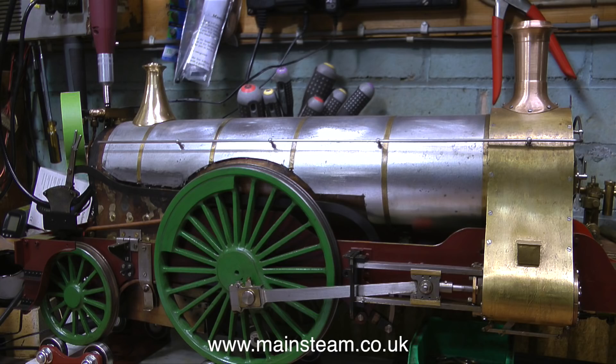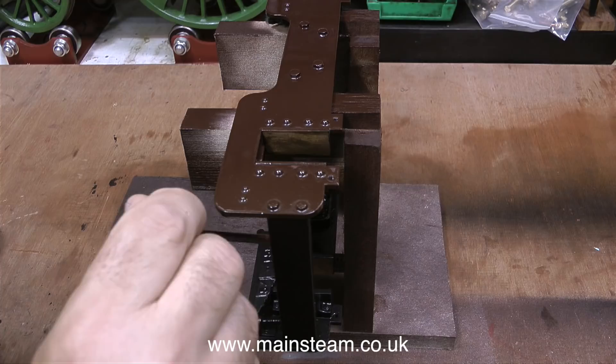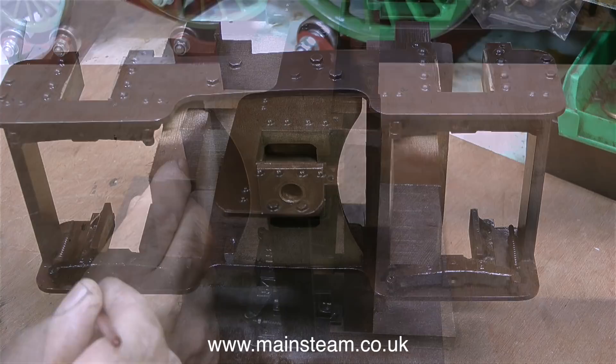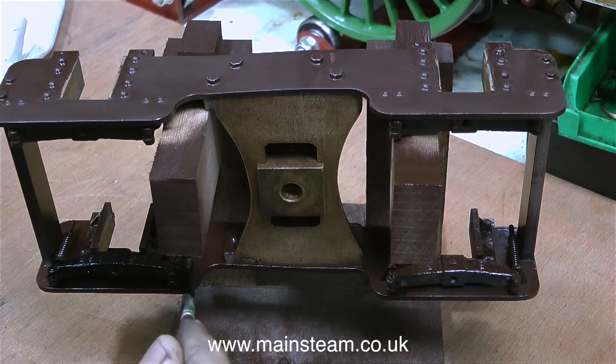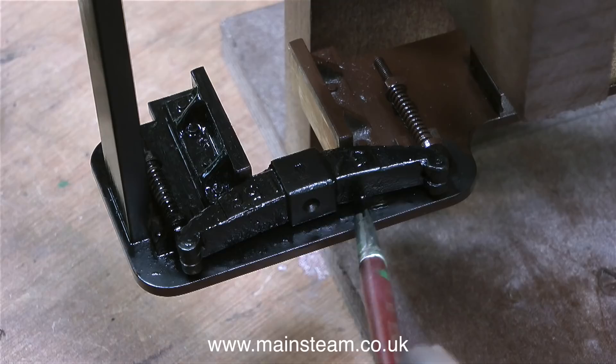So what have we here? It's a piece of wood — a painting jig. They're very easy to construct out of scrap pieces of wood and they do make painting parts like this a lot easier. For instance, if I was painting inside the frames holding the part in my hand, by now it would be getting very heavy. The painting jig takes the strain and allows me to put the part exactly where I need it. The main benefit is that you can make sure the surfaces you are painting are horizontal and not vertical.